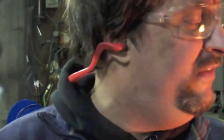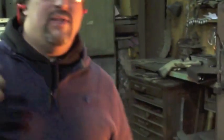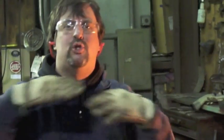A tube with powdered steel inside of it, the flux really is an indicator for me to tell how hot it is. It really doesn't help the tube. The tube traps everything inside. Whereas if you're doing layers of Damascus, you want that flux on the outside so that the oxygen doesn't get between the layers.